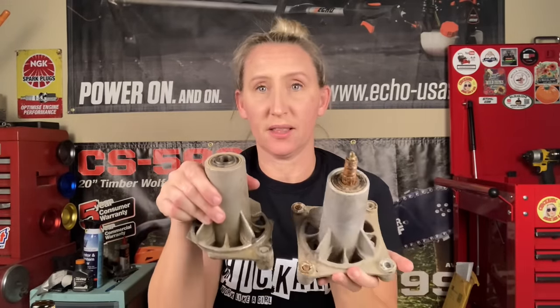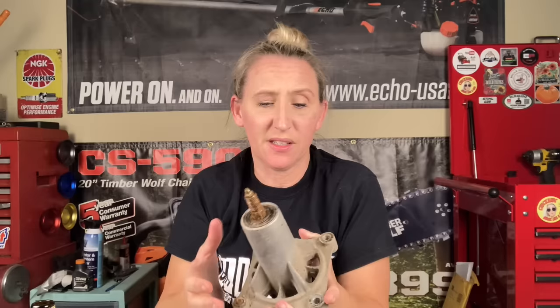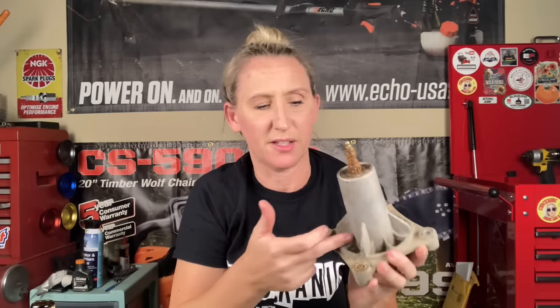These spindles I'm fixing to show you have been out for at least two to three years, and you might own one. In the past, they've had the same spindle, which looks just like this one right here — this is what we've seen for maybe 10 to 15 years. Before that, they had a three-bolt design. These have been the same exact spindle forever. They have the fake Zerk on top, which they started a little while back. Before, they didn't have a Zerk — you might have seen a Zerk on the side. Eventually everybody found out when you broke these open, the bearings were sealed. You can put as much grease as you want in there, and it's still going to help a little bit, but it's not getting to the balls in the bearing.